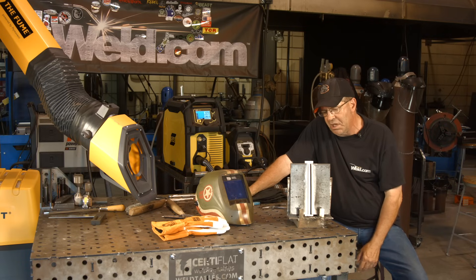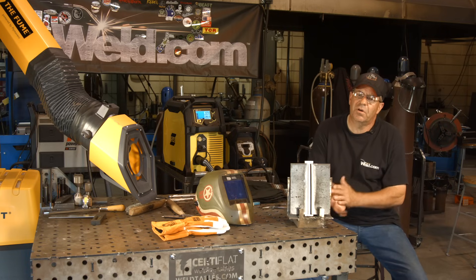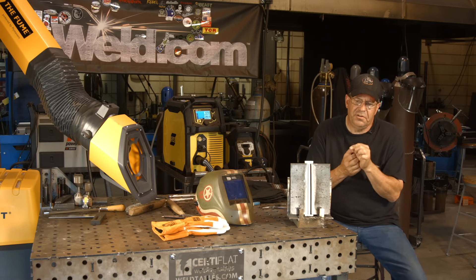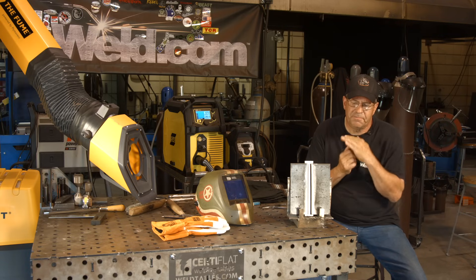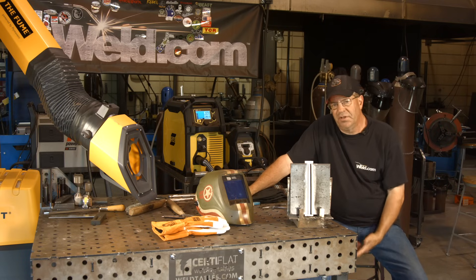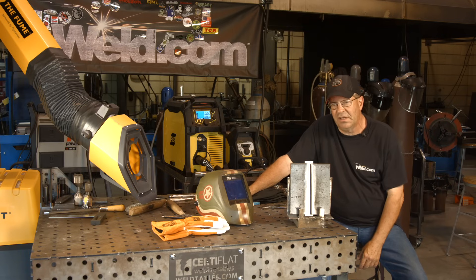I don't want to leave it behind if it happens. The times it has been left behind on some of our piping work, we go in with a light grinder sander and just touch them. They're not very deep — I've ground into them a little bit and bead brushed them. We x-rayed the welds and it hadn't been a problem. The inspectors looked at it and said they know what it is and it's fine. It's really only about a 32nd of an inch deep. Now if it gets actual porosity, grind that out for sure.